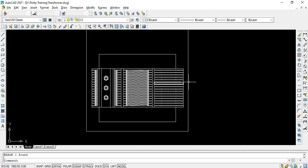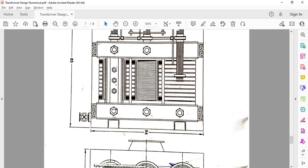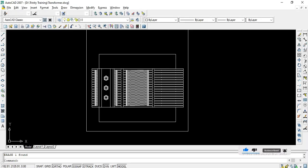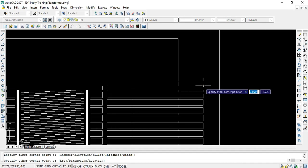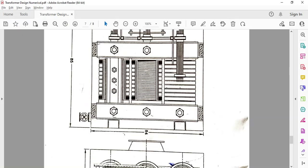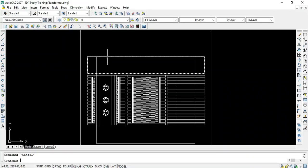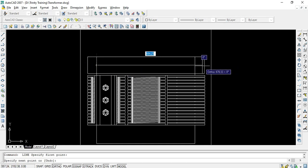In this drawing, all the laminations are stacked using a metal C-shaped clamp. We have to show that from this point to this one, so I'll draw one rectangle for that purpose. Due to this rectangle, these lines will not be visible. To show the nut bolts, we require a center point, so I'll draw one line here.